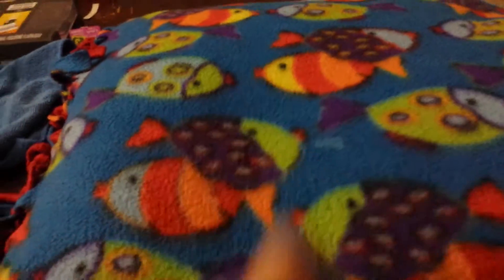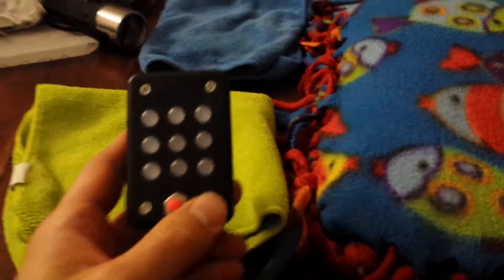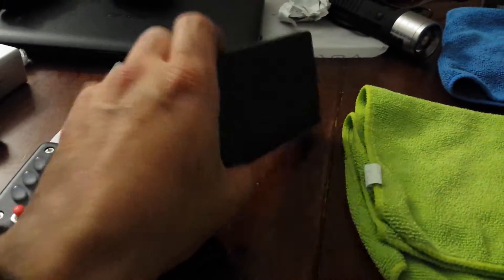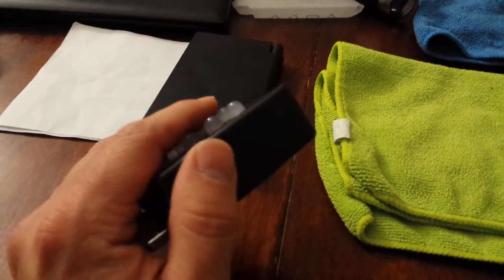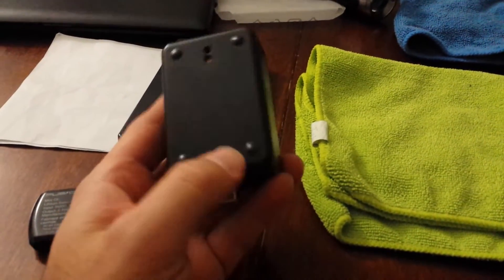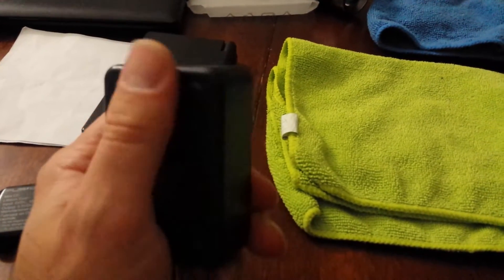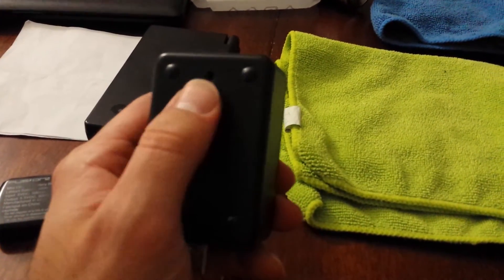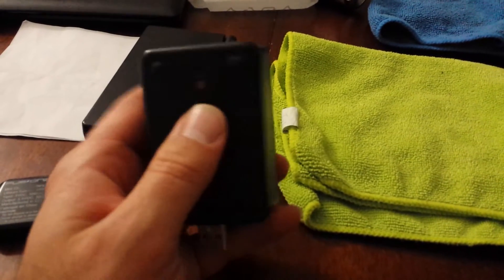I have a green here, a blue, and then multiple colors on my girlfriend's pillow. The only thing you need to do before this works well is calibrate it by showing it white and black. I noticed it's not perfect, so you will get some error, but for the cheap way that's actually pretty good. For those who have more money and want to spend more time coding, you can buy a color detection module — I've seen those from a few dollars up to $20 or $30. But a photoresistor is cheap and you can get those anywhere.